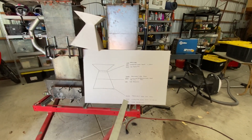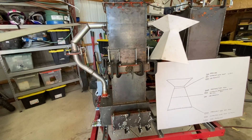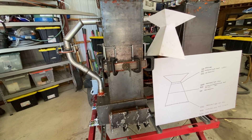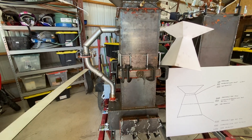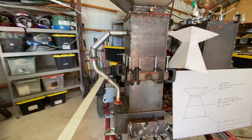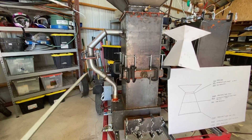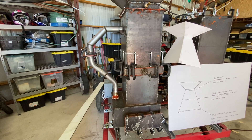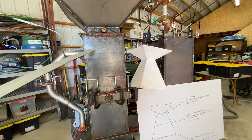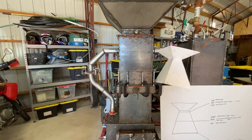A couple of other changes I've made since my last video: I got rid of the cyclonic filter that was a remnant of previous designs and put in this kind of hokey muffler pipe affair to replace it. The cyclonic filter was just clogging up and it was very difficult to clean. What I'm going to do instead is just trap the soot up here in the preheater, and I have a mechanism to flush it out that's easier than disassembling and cleaning the cyclonic filter.